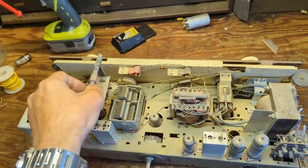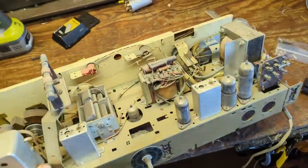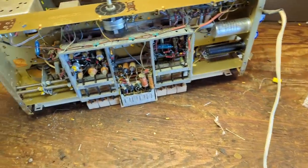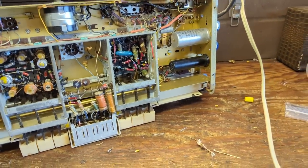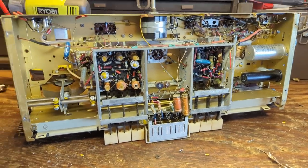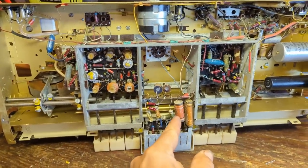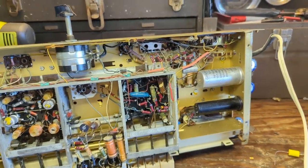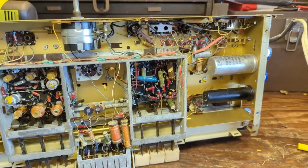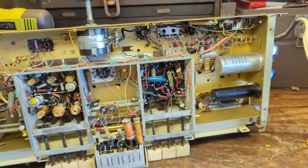I wonder if it is - maybe it's a C9 size. So here's the innards. Unfortunately you really can't set these guys on their top because you'll break this. Sometimes you can just tip them like that. There's not a lot going on here. It looks like the bare minimum has been done - the electrolytes were replaced and that is it. The rest of the original paper caps are here and these go just as bad as any other paper capacitors. They all need to be replaced. Here's the switch - it's difficult to access. It's not acceptable to have something you can't turn off like that.